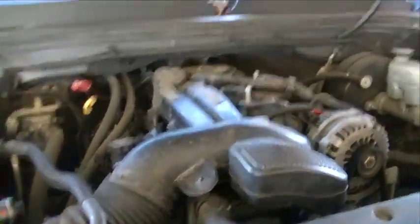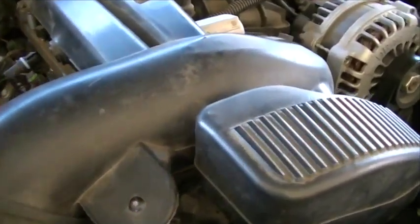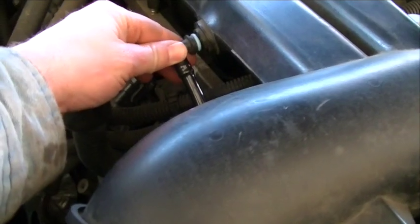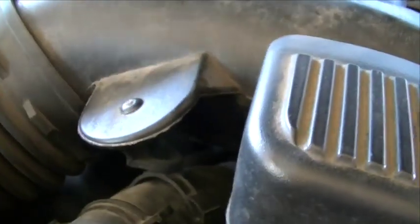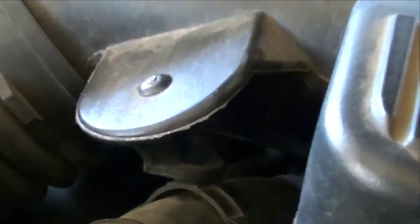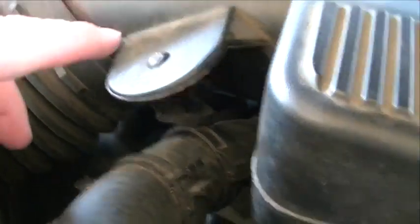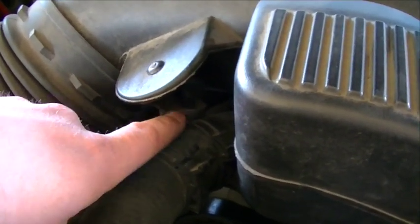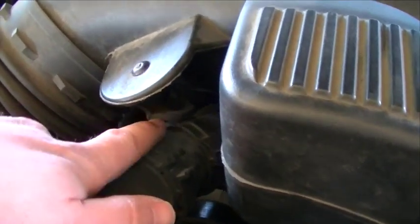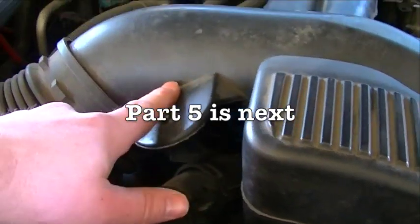It's a new day and I had to put the old air tube back on the truck just so I could drive around. I need to make a fitting on the new air tube for the PCV connection. There's also a little clip under here — I always refer to them as Christmas tree clips — and this upper radiator hose does have some support from the air box. So I'm going to fabricate a little tab on the new air intake tube so I can put this clip and have that support for the radiator hose.